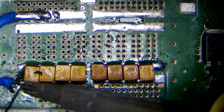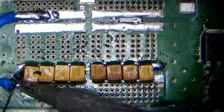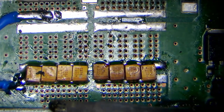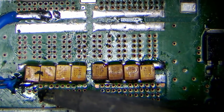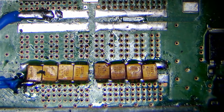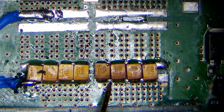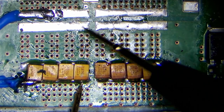So, yeah, we're just making sure we get some good solid solder joints on this. We don't want this wire burning up while it's in operation. Again, it's a high current part of the circuit. These old PlayStation 3 FATs, they have very high power draw. I believe they are a 95 nanometer process, which, to give you perspective, these days we're down to 7 and 5 nanometers on typical chips. So things have come a long way.